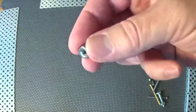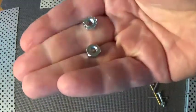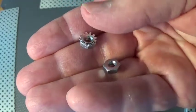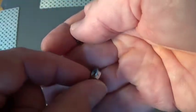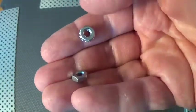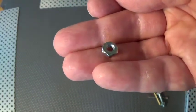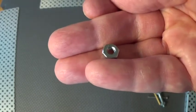So why would you use the different ones? The Keps nut and the standard nut are a lot easier to get on and off a screw. You'd probably only want to use the standard nut for building a prototype or just experimenting, because they're very susceptible to vibration. These robots get beat up a lot on the playing field, so you probably wouldn't want to use a standard nut for your final design.